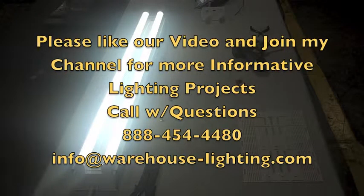With our kits, you can call us and ask questions. This gives you an idea of how to do a regular four-foot fixture. If you have more lamps in the fixture, all you do is use more jumpers and go from one tombstone to the next. Always remember to use un-shunted sockets for a single-end LED lamp. You want to remove all the components from the old fixture and recycle everything. You can always call and ask us questions at 888-454-4480. Thanks for watching and have a great day.